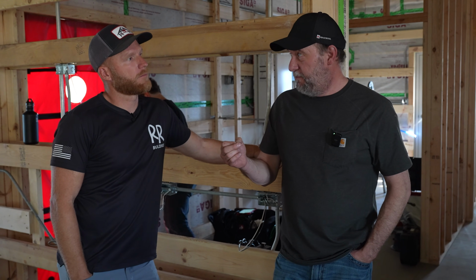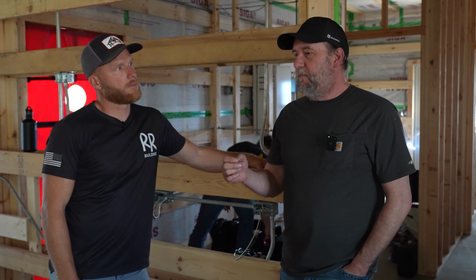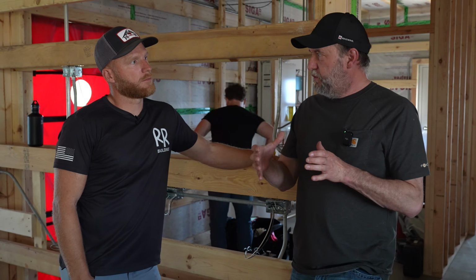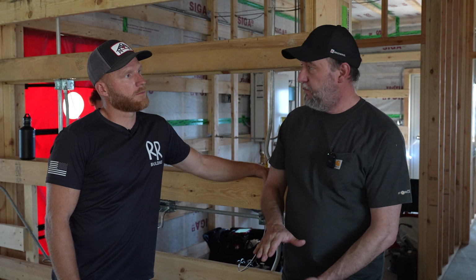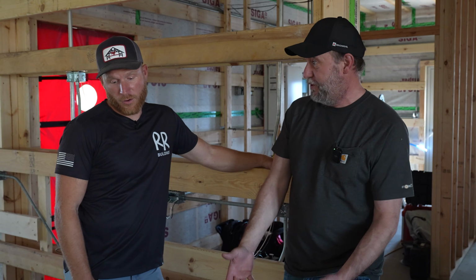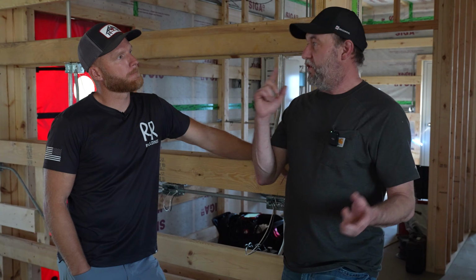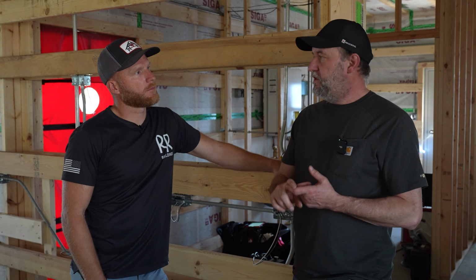So this building you scored 166 CFM, which is awesome. Which ended up being what, a .43 ACH 50. But there's another metric we can use to identify the air leakage of this building, and that is the CFM per square foot of surface area. When we figure that, we're counting the lid and the floor, so we're able to count the square footage of both. Hopefully we don't have any leakage in the concrete floor. Then all the exterior walls, or walls that go into the garage. They're part of the envelope. And what you ended up with on that was .023.